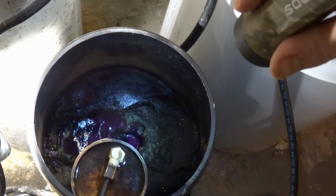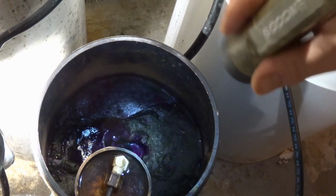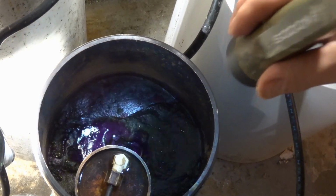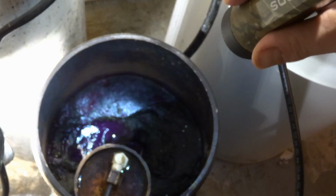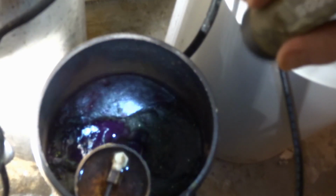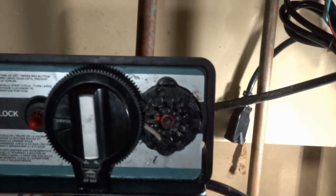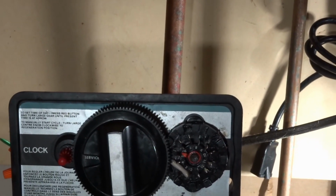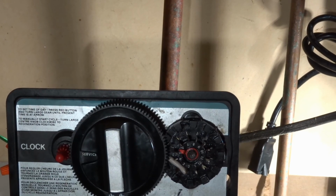There's actually a mesh filter about an inch lower than that where you can see the water. So to me that's good. It should just be touching the bottom of that mesh, and I'm gonna have to watch a few cycles and see if it's gonna fill too much or not enough. That's simply that little white adjustment on the very back of the machine, which we talked about. That controls, I don't know if I have it here. Yeah, I do.